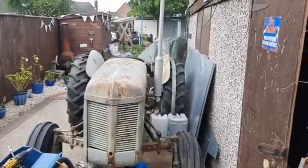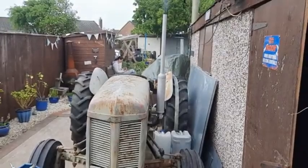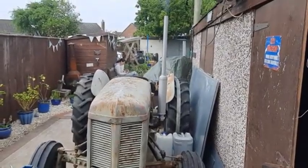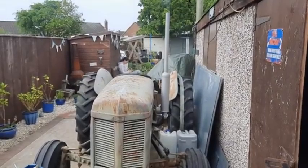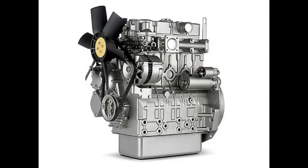Absolutely. Okay, let's move on to the top end of the engine, the cylinder head. So this is where combustion happens. It's a pretty critical part. So the manual goes into great detail about removing and installing the cylinder head, including precautions for handling that asbestos head gasket we talked about earlier. It also covers overhauling the cylinder head, which involves inspecting and reconditioning the valves and valve seats.